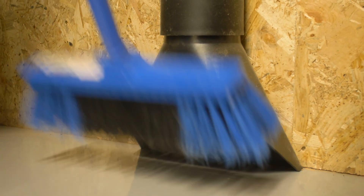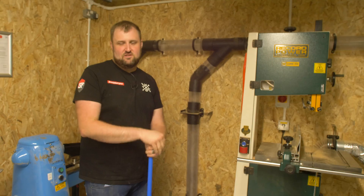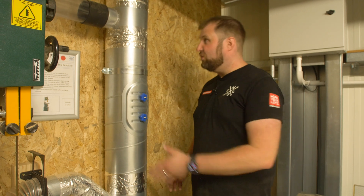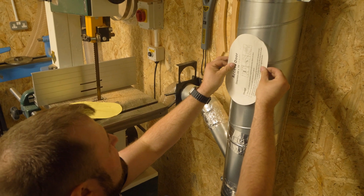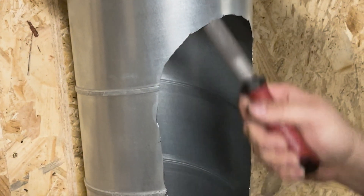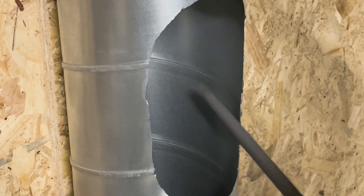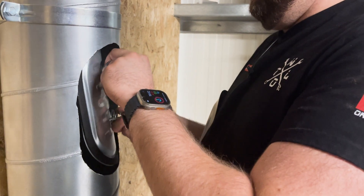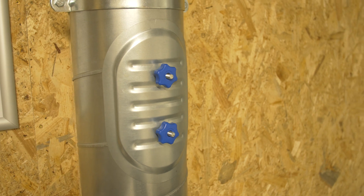And there we have it — that is how you build a ducting system. Big thank you to Axminster for coming down and giving us the advice to get a really good efficient system. Another thing we added was this access hatch. It's for if you want to test the airflow or clear a blockage on the main leg. These access hatches come with a stick-on template — you stick that on where you want it, use the grinder to cut around it, then file it down. Filing this metal is probably one of the most annoying noises on a building site. Once done, this slides in sideways, it's got a foam seal, you tighten it up and that's the access hatch that will allow us to check airflow and clear any blockages.